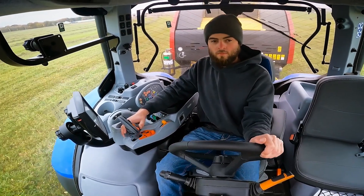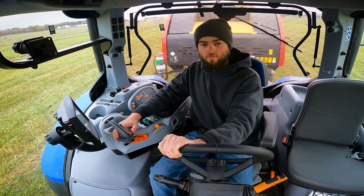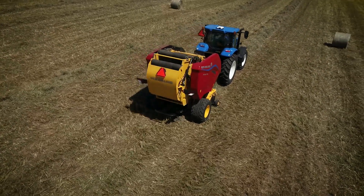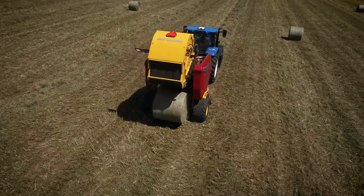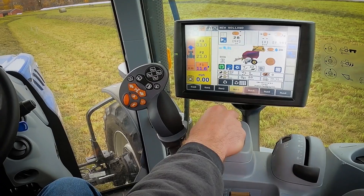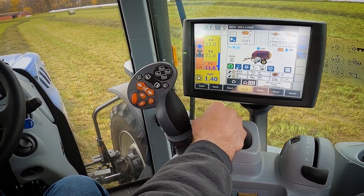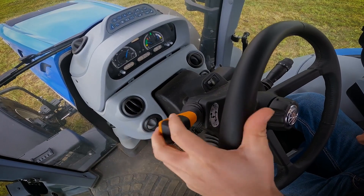For the pinnacle in operating efficiency, look to our PLM automation solution IntelliBale to work smarter and make even your longest baling days feel shorter. When matched with a compatible tractor, IntelliBale automatically stops the tractor's forward motion, performs the wrapping cycle, then ejects the finished bale before closing the tailgate. Stopping the tractor's forward motion can mean more consistent baling, while stressful full bale alarms and urgent stopping is eliminated. Once the cycle is complete, all you need to do is reactivate the system by shuttling the tractor forward.